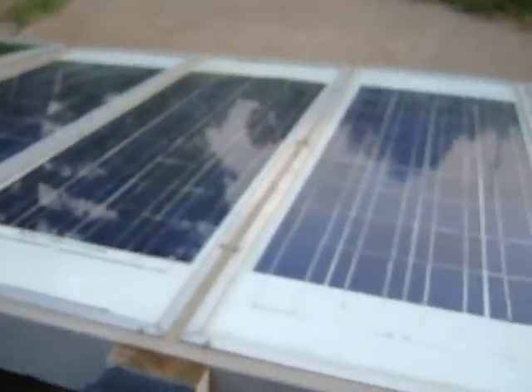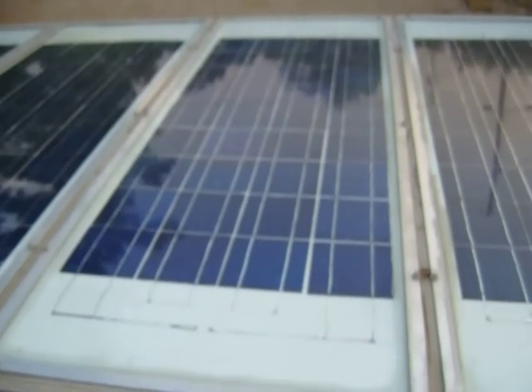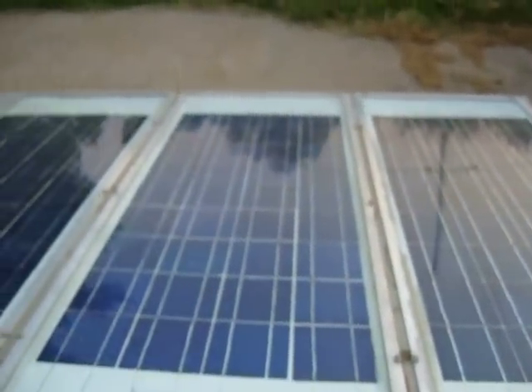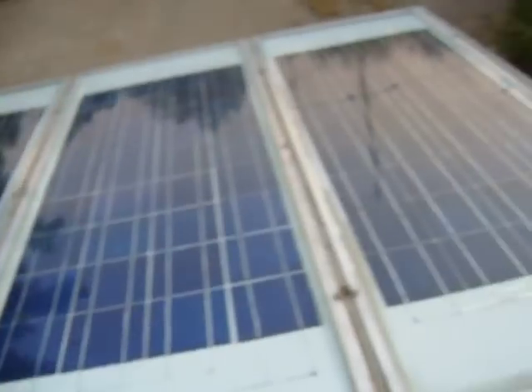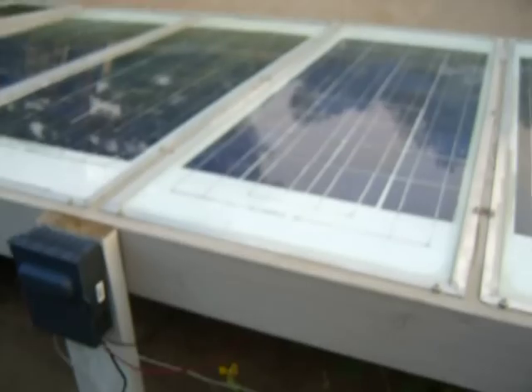Maybe if I use two of them, but it goes through the window nicely. What I'm going to have to do is order some wire. The outcome of hooking these up to the GTI during the hours when I had good sunlight — I unhooked those other panels from the GTI and just had these going — it said 20 watts, which is just terrible for four big panels. So that wire is not going to carry enough current to get any usage out of my panels, and I might need to rewire the backs of these things anyway.